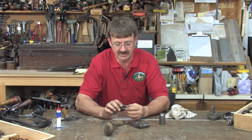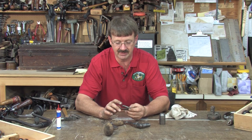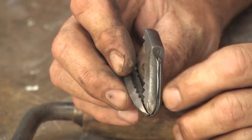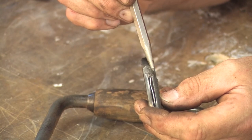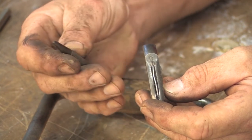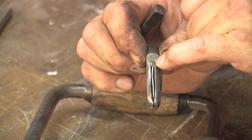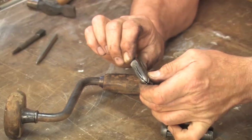The problem we had with the jaws — these are a little more second line. The cheaper jaws don't have springs; these had a spring. This is how they had the spring pinned: it was simply put down into a trough and part of it was peened over. Well, that had broke loose on the other side. So what I did was I used a finer punch, moved some metal out of my way — it's pretty malleable, pretty soft — then used a flat punch, an old broken nail set. Once I held this in the vise, I was able to push this wire back under, push it down with a pair of pliers, and then peen this over here with a small hammer and set it with a punch. Now I've repaired my jaws.